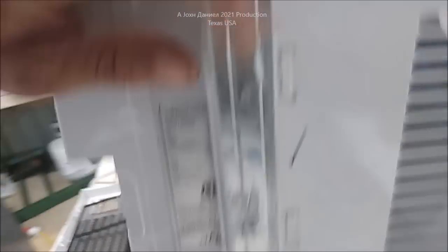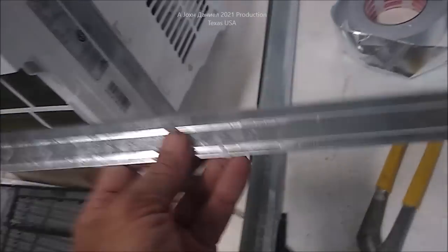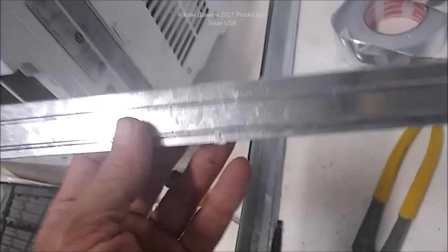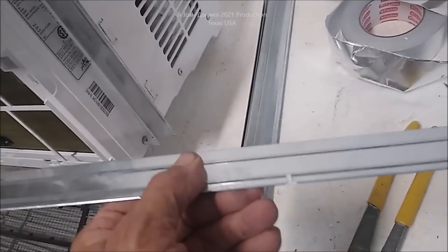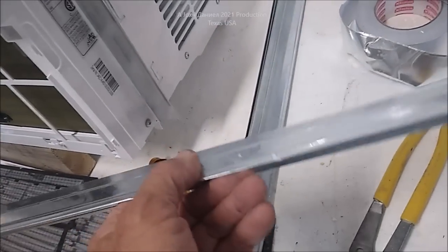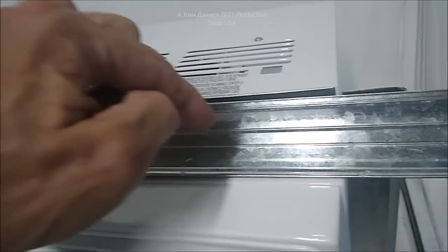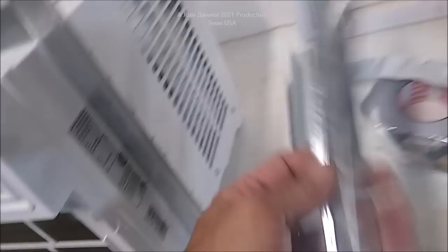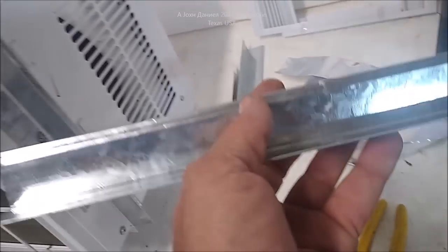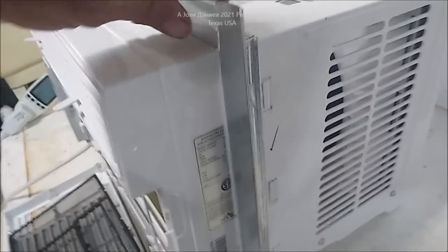If you're going to mount this through a house wall, you'll put rivets through your metal — see those screws right there. You're probably thinking this little flimsy 26-gauge sheet metal is not going to hold that air conditioner. But I mounted a 16,000 BTU Friedrich doing this and it's still in the wall today. The reason is because your contact point is so close — screws in the wall, screws in this — and then it's squared, and that metal holds it just fine.